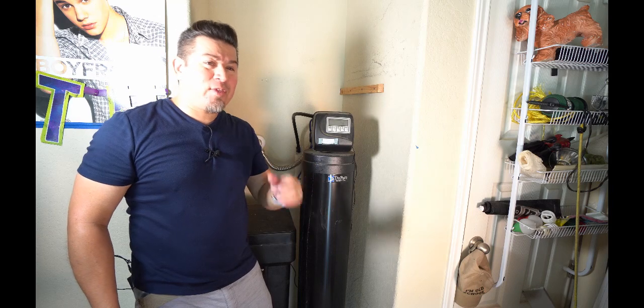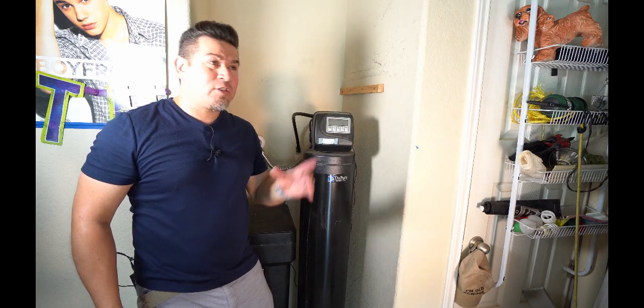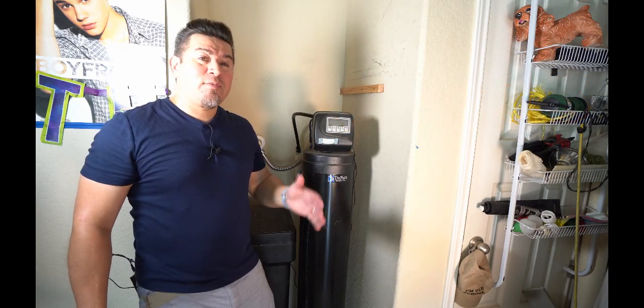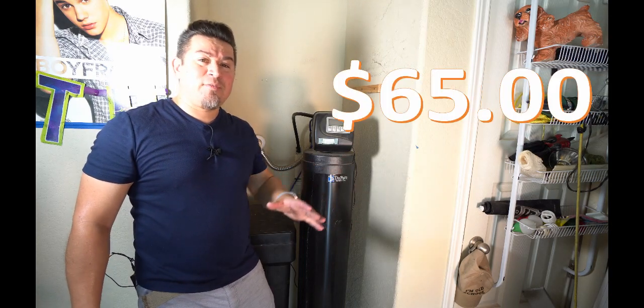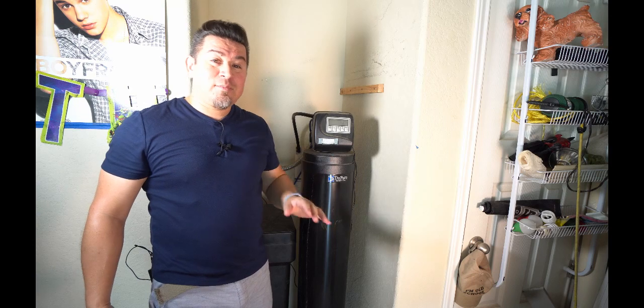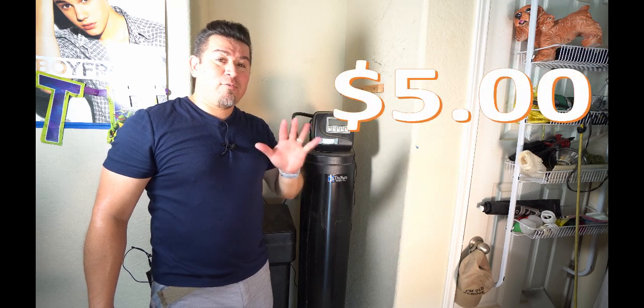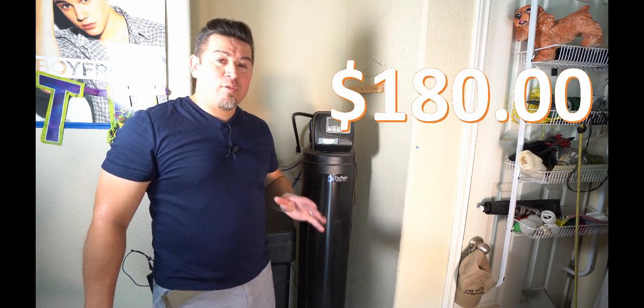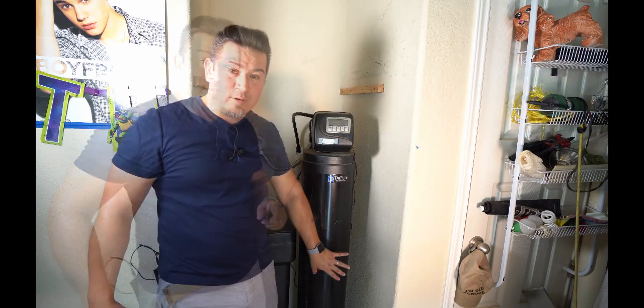Now, I did some math, and water in my area costs 0.13 cents per gallon, which doesn't sound like a lot of money. Over the course of a year, it's about $60 to $65 worth of water to backflush the system like it normally runs. Again, it doesn't sound like a lot of money, but hang on. When it comes to the salt that I'm putting into the tank, I put about 80 pounds a month. That's 2 bags, and it costs $5 per bag. Rough and tough, it's about $180 worth of salt that I'm putting in the system, plus the $60 that I'm putting in for the water.